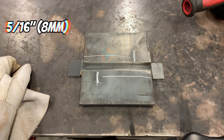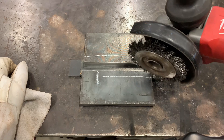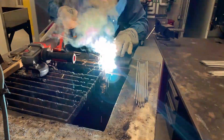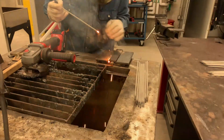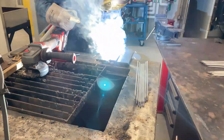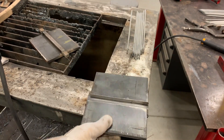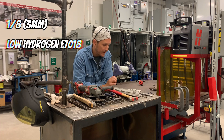Make sure we clean our plate off well — get rid of any rust or any heavy mill scale — to improve our chances. Just a reminder: if you're assembling your plate yourself, your tacks should go on the back side and no larger than three-quarters of an inch from the edge of the plate. Once that's done you can clean up your tacks, clean the slag off, clean the inside of your joint, and then start putting your run-off tabs on.